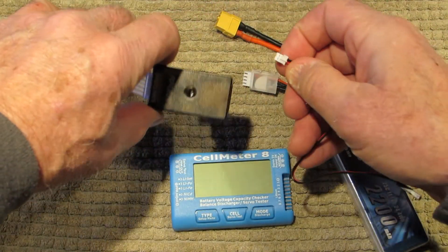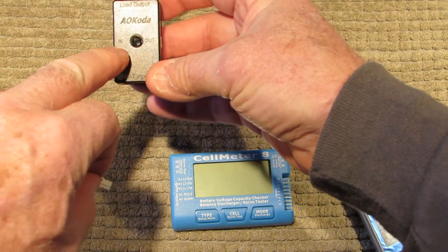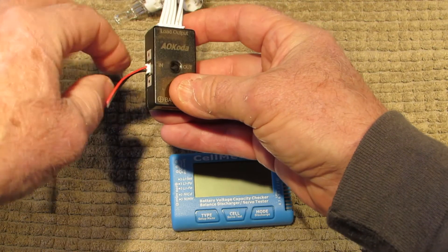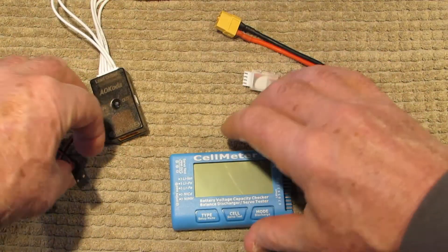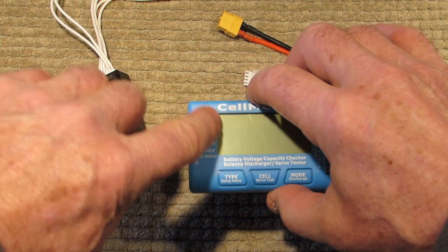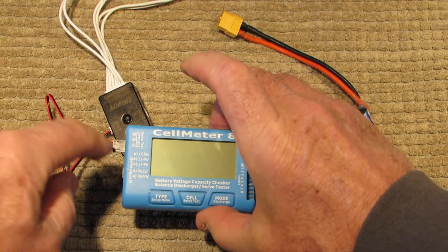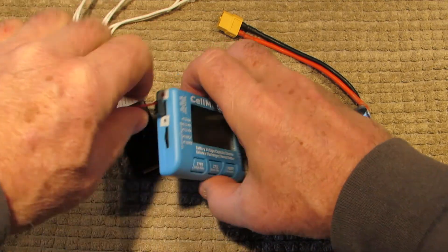The lights are our load — that's plugged in. We also need to plug this little red wire into the inside of the unit. When facing it with 'in' on the left and 'out' on the right, red wire away from you. I put little marks on mine so I remember what's red and what's black. The other end of this wire goes into the servo port where we had the servo plugged in for testing — again, red wire away from you.